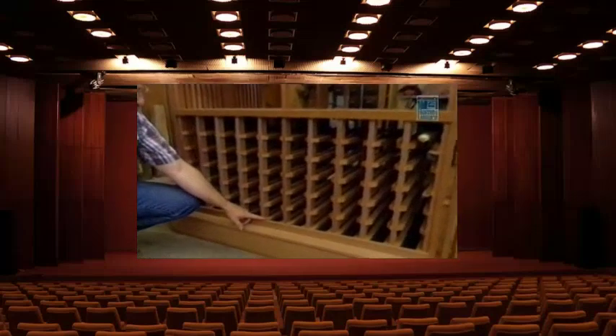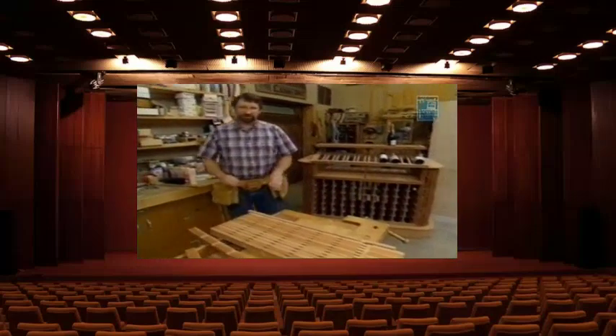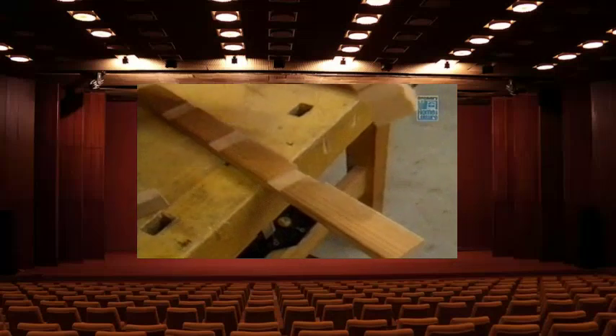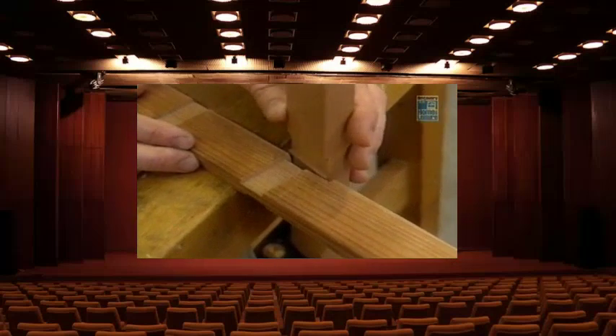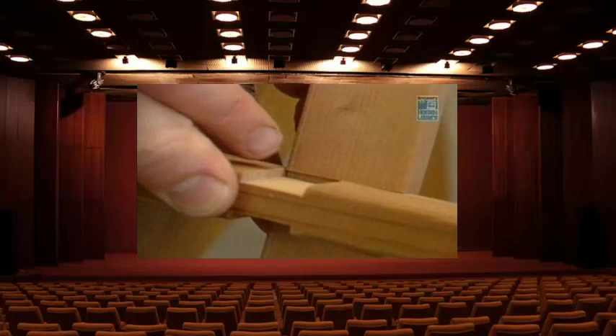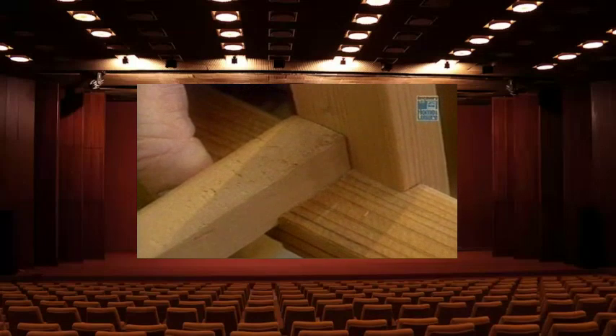All the remaining cleats that support the bottles are not beveled — they're just cut square. Here's one of the standards with a notch at the bottom to receive a rail which will tie the standards together. There's a void in there that makes for a loose joint, so for each of the cleats I rabbited the end so there's a little bit of material left which will slip into that void, making a much tighter joint.